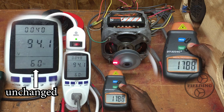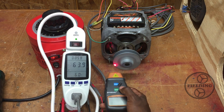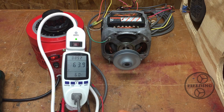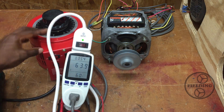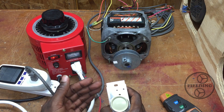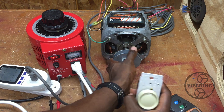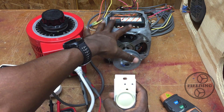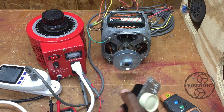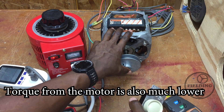Close enough. At about 64 volts from the transformer, we're still registering about 1780 RPM, and my motor is actually starting to make a noise. The point is that even at half the voltage, the speed is the same. If this motor were under load driving machinery, it would begin to slip. Eventually, the voltage gets so low the motor is starving — it can't produce a strong enough magnetic field to keep up with the spinning field, and it begins to slow back down. This is damaging to the motor because you're drawing more amps than you should be.